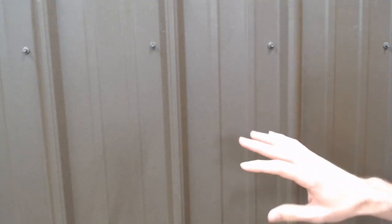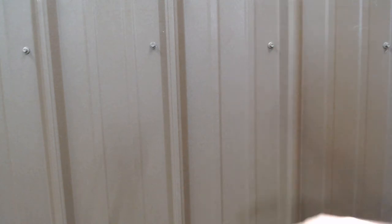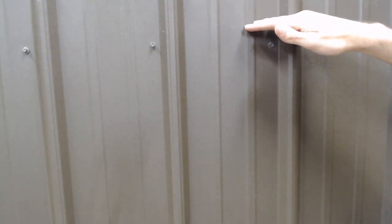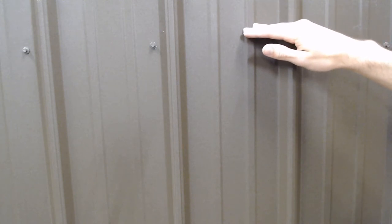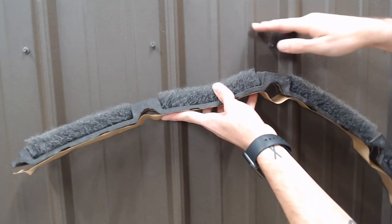The purpose of an outside closure is to close off the gap between your ribs. We've got nine inches of space between each rib on our tough rib panel, and you need to close this off to prevent access to your attic space — otherwise you're going to have bats, wasps, squirrels, and other bugs trying to nest underneath there. You can use a solid closure strip, but that won't allow your attic space to breathe. If you have vented soffit, you still need airflow coming out of the attic, and that's where the vented closure strip comes into play.